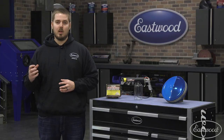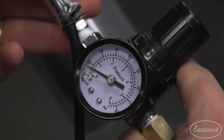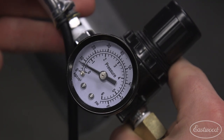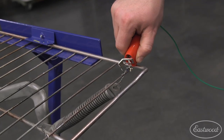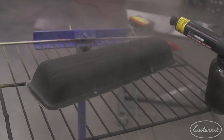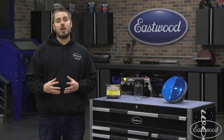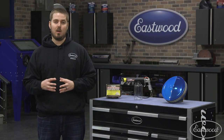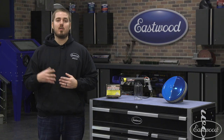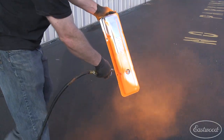Powder coating is simple. Start by cleaning your part with pre-paint prep, screw the powder bottle onto the gun, connect the air line with the PSI set between 5 and 10, and attach the ground clamp. Then just spray the powder. Simply work around the part, starting with the corners and edges, and then work to the larger flat areas. This is where the dual voltage gun really helps, because it allows you to get the best coverage in both tight areas and large flat spots. And a great thing about powder — if you do make a mistake and maybe bump the part, all you have to do is blow it off and start over. Nothing like when you get a run in paint.